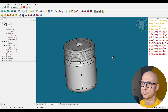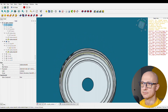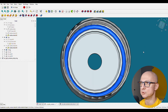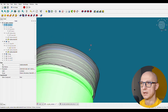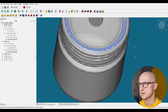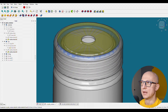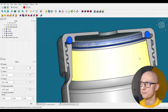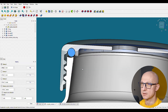Here's the cap sitting on top. I made it transparent so you can see a bit better. There is a cap with the threads. Here is the o-ring — I made it blue so you can easily see. The idea was that when you screw in the container, it will seal here. But actually it was not working great. When preparing for this video, I figured out what was wrong. You can see this crosscut of the object — it is now obvious that I designed it incorrectly. This arc here is not matching the o-ring, so probably this was why the design was not working properly.